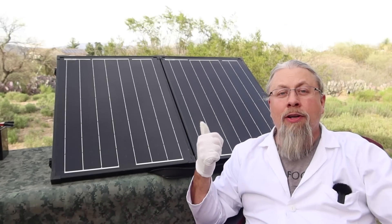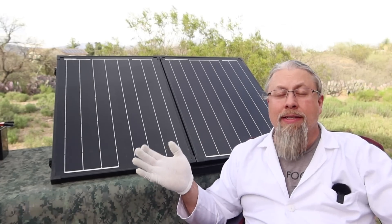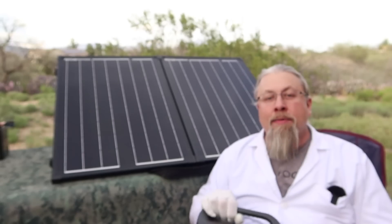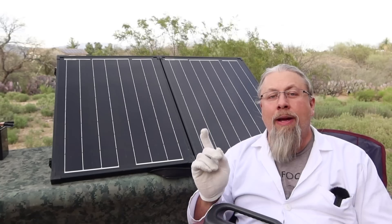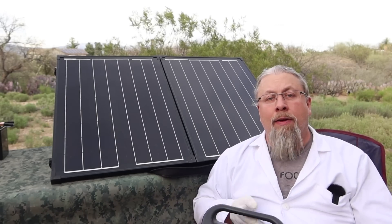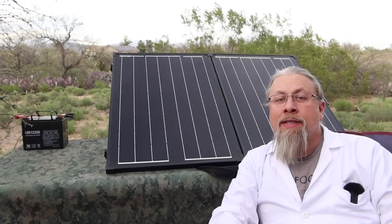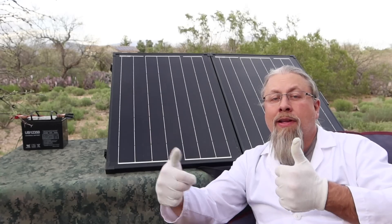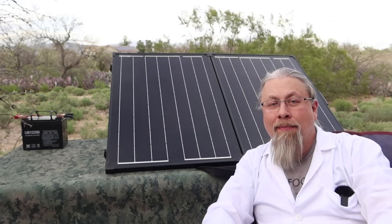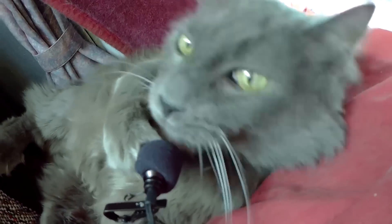This just might be the solution a lot of you are looking for — something rigid and sturdy that hooks up directly to your RV or van batteries. Unlike a regular folding solar panel without a controller, this is ready to go as long as you're trying to charge a battery directly. And like I mentioned, you can use this to charge a Jackery — however, you have to bypass that controller and run the wires directly from the solar panels into the input. For the Jackery 1000 it'll be a little slow, but for the 240, 160, 290, 500, 130 watts is plenty. Hope you enjoyed the video — if you did, give me a thumbs up and subscribe. Odin commands you to like and subscribe and clean his litter box.